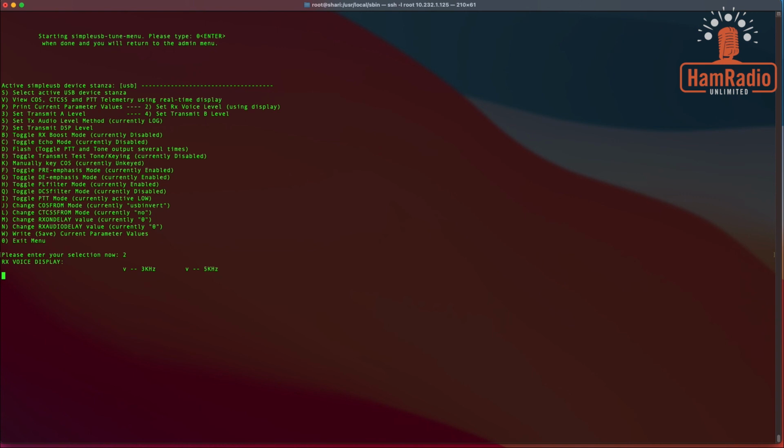Let's see here. Let's enter. The current setting is 500. I could probably almost go to 900 as low as that was. We'll see what it does. Kilo 3 Delta Oscar, testing 1, 2, 3. There we go. That's much better. It probably could go up a little bit more.